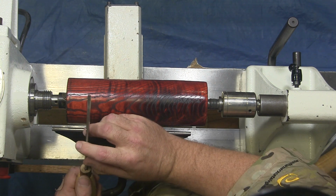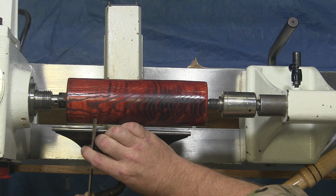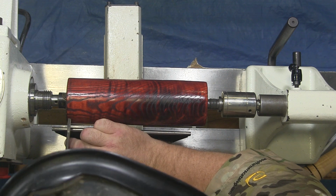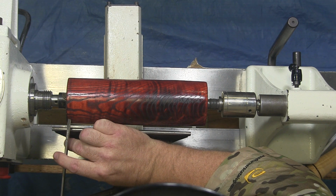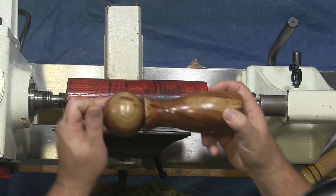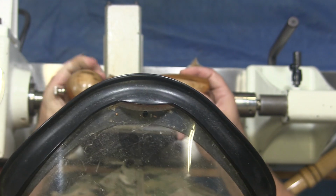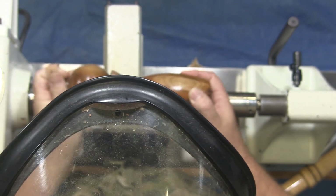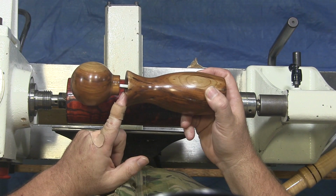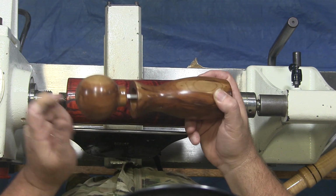But you put it on your platform. Put it on your platform and grind it this way. Okay? And that's sharp. And I've used this a lot for parting. I've not used it to make tenons. And that's basically what I'm going to do here. What I'm looking for is to find my tenon, my spigot, and a place to part it. Okay? Everything else doesn't matter right now.